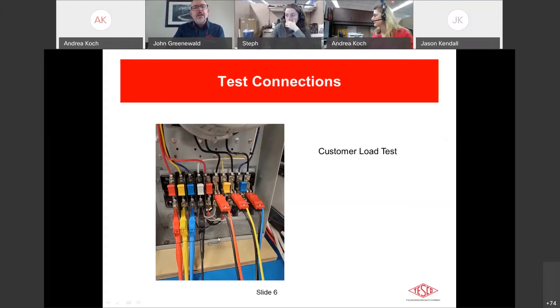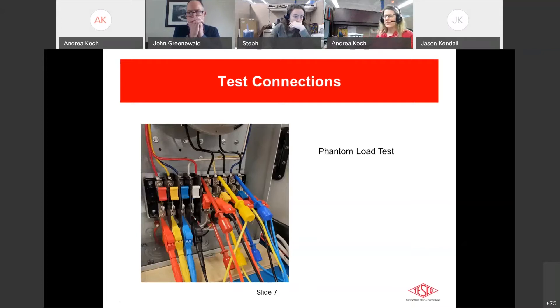The voltage connections from the test kit are connected to the service voltage powering up the test kit. Inserting the duck bill plugs into the test switch places the field test kit into that CT loop without disrupting it. Current comes off the CT, into the duck bill probe, out into the test kit, back out, and through the meter — continuously making that loop with the field test kit now inside it. The test kit picks up the customer current and compares energy measured by the meter versus its own calibrated reference standard.